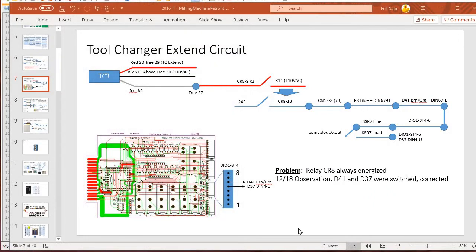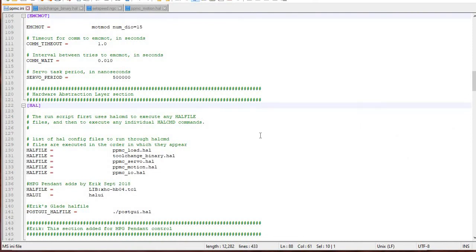To give you an idea of how this connects into my system — I'm using the PPMC infrastructure. There's a card from PPMC, and there's a solid-state relay here. When PPMC D-out number six is energized, it closes this solid-state relay, and that hits 24 volts to the mechanical relay I showed you. The other side of that relay hits 110 volts to the solenoid, the solenoid actuates the cylinder and it moves. That's how the system works. Now, how do we actually deal with that inside of LinuxCNC?